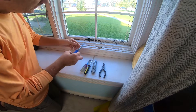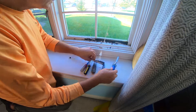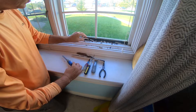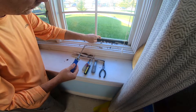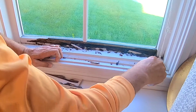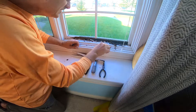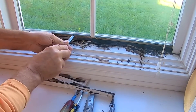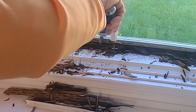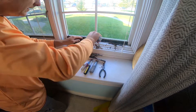First things first, let's get rid of this rot — start chipping away so we can see what we're looking at. You've got to be careful not to pry off the glass because it'll break, so don't do this with pressure going against the glass. That's weather stripping right there — it's a softer piece. There's aluminum skin on the outside, and literally from end to end this looks like it rotted away. So we're going to have to rebuild it from here or fill it.